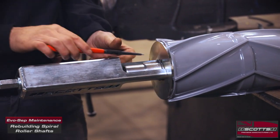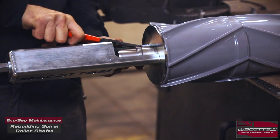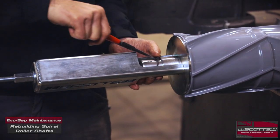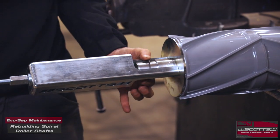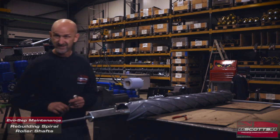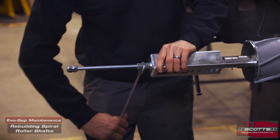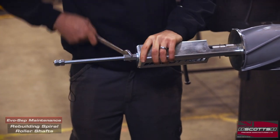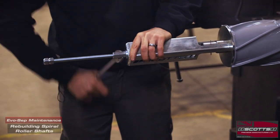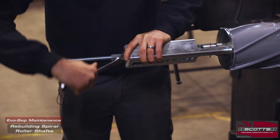We need to seat the circlip fully off. Slip the circlip pliers over the circlip, pull it all the way back so it's now off the shoulder and loose on the end of the bearing fit part of the shaft. Then it's just as simple as popping the spanner back on the barrel nut and unloading that tension we've already put on — that allows the end disc to slide up the shaft and takes all the pressure away.